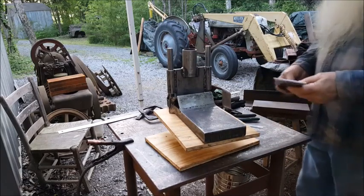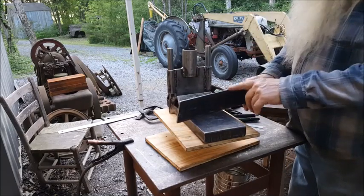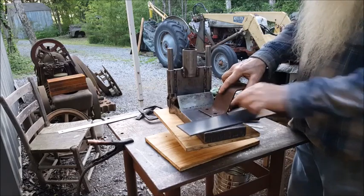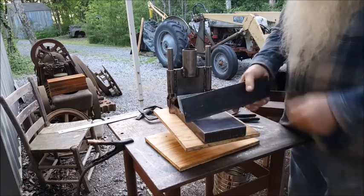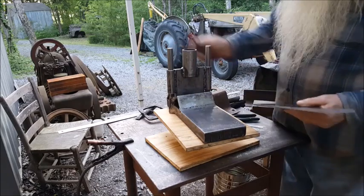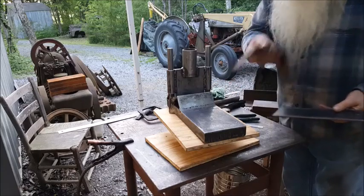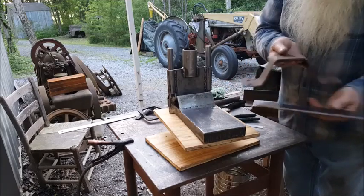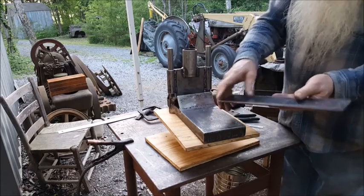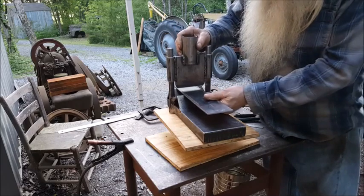Raw material, that's 3/16. That's what this is right here. Measured out the same right there. You run your finger across there. 3/16 by 3. This piece ain't long enough, but the way you would use it, you would lay this out. Imagine it was one long piece, and you do the measurements on it right there. Just scribe some lines on there. Put this right here in there like that.